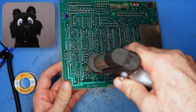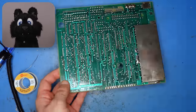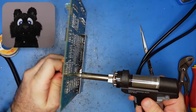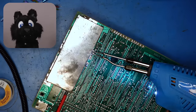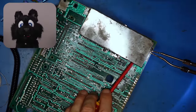A quick recapping is naturally on my to-do list. All of the electrolytics on the main PCB are just voltage stabilizers. Inside the RF modulator, two of them are used for DC filtering too, but nothing critical. Some shielding needs to be removed — there's plenty of solder on that, so it took quite a bit of heat to open.